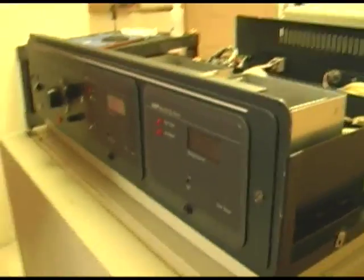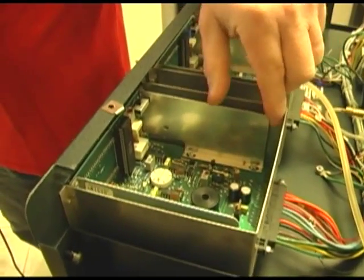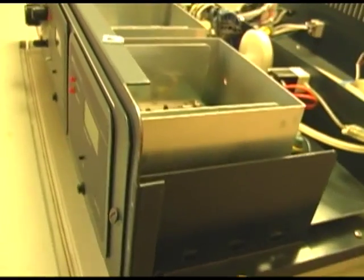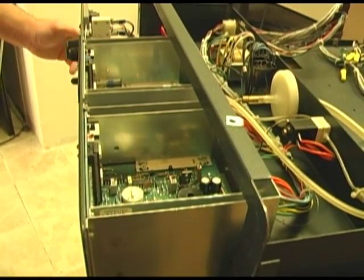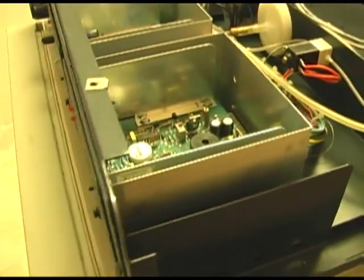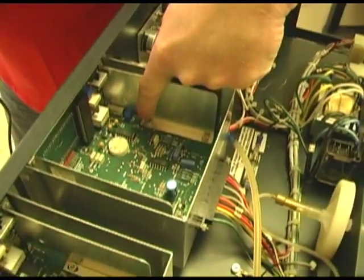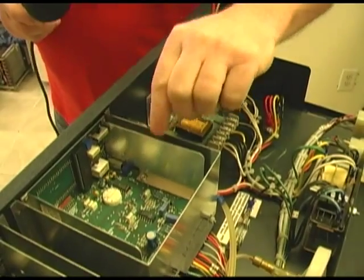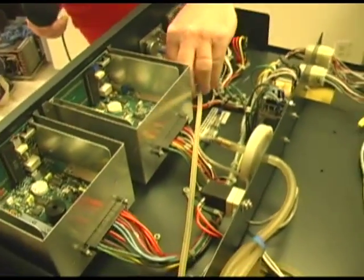Let's take a look at the electronics. Here is your monitor for your alarm — note that this simply pulls out. Push the button in the front of the instrument and that whole module will come out, just like a drawer. That saves you from having to take the top off. On to the CO2 module — you can see how this pulls right out. There's a small pot here that you can use to change the gain of the instrument; that's a calibration adjustment, not a set point.